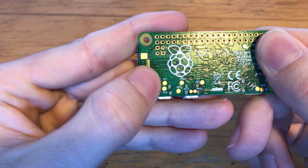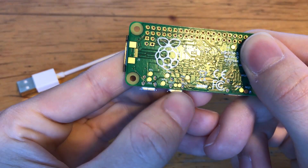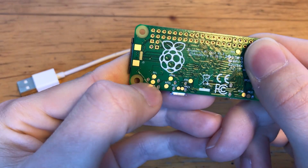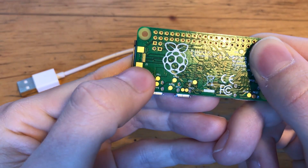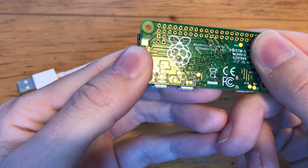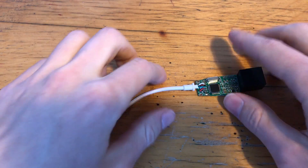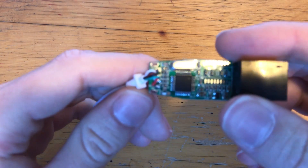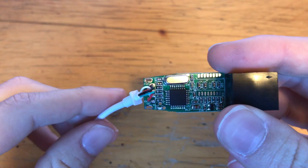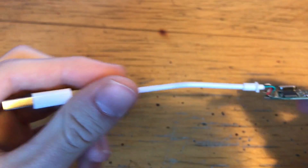If you look on the underside of the Pi, you can see there's a load of gold pads and these are quite useful. PP22 and PP23 are actually data lines for the USB port just underneath those. And over here, PP1 and PP6 are positive and negative lines that you can use to power the Pi. So that's going to come in handy. Looking at the adapter again, you can see there are four wires coming from it — those four wires are going to include the positive, negative, and two data lines, so I need to figure out which of those is which so I can connect it directly to those gold pads.